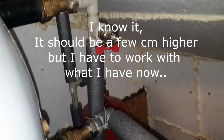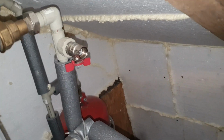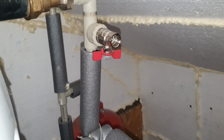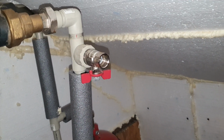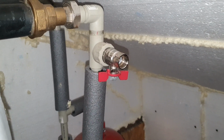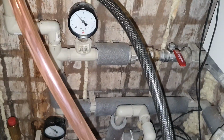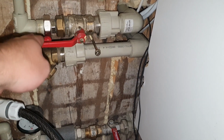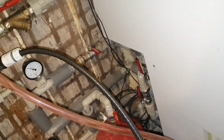The valve to drain the air out of the system is at the highest point, and as you see, a lot of air is coming out, and that's alright. It's probably because downstairs I forgot to take out this little piece, so no air came out, so I'm now happy with this. I just let some air out and then I will keep pumping because I already got 2 bars pressure. I stopped pumping outside upstairs. Just water is coming out now, and the last thing I did, I opened both valves for the heat pump, and then I pumped a few more liters, and now it seems alright.